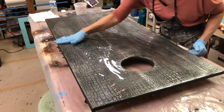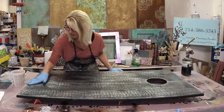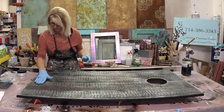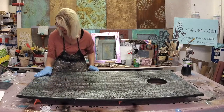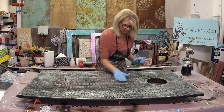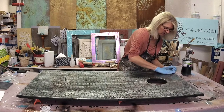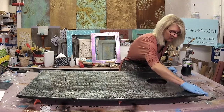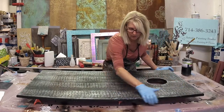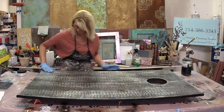You want to make sure wherever this piece sits that you have it level — get your level out and make sure your table or wherever you're pouring is a level surface, otherwise it's going to run off in one direction. I'm going to try to keep one hand clean so I can use my blowtorch. Now, even with the crocodile roller on here, I took the time to sand that texture down well so it wouldn't take a whole bunch of extra material during epoxy coats.